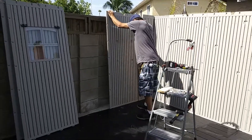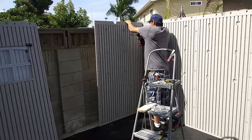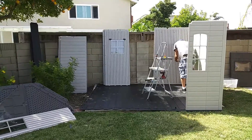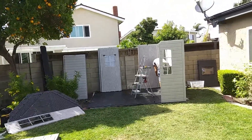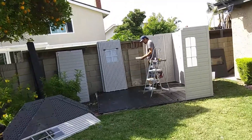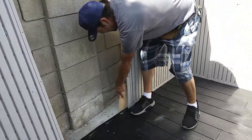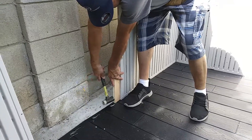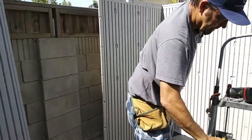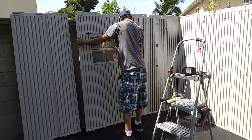On to the next panel — drops in the same way. You're going to get a solid panel, and then the next panel after this is going to be that window. So it's all staged to the left there, nice and perfect, ready to go. That will be the center of the back wall where the window's going to be. I'm putting that first solid panel in, going down that spline with the five screws, snugging them up. Remember, set your torque on your drill gun halfway to the low side. Here's a great example of the wood block: make sure the panel's a nice tight run. You line it right in the grooves, just like you see here, and give it a couple of taps. Perfect illustration of how this block can be used to line those panels up nice and get a good tight fit on all the panels.